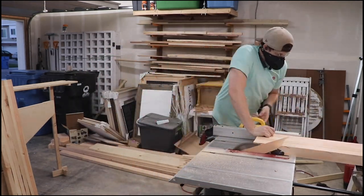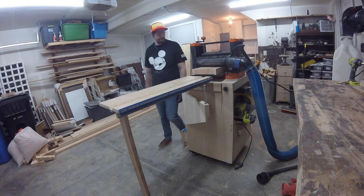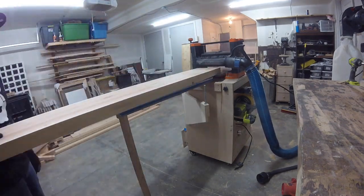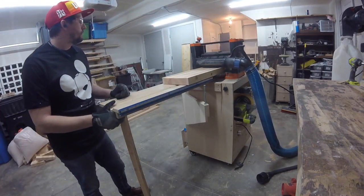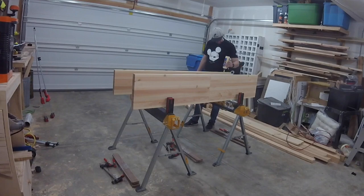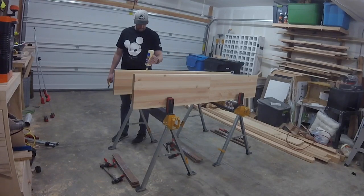The process was pretty easy. I just used a couple of dowels through the center to make sure the boards stayed straight. After that, I planed the two pieces that are now the full length of the bench, and then glued them together to give me the full width of the bench. I used a couple of support pieces of wood to make sure that the bench stayed straight while the glue dried.